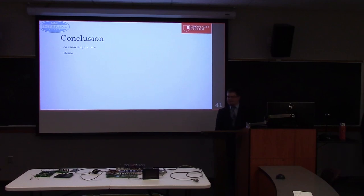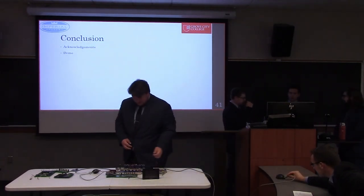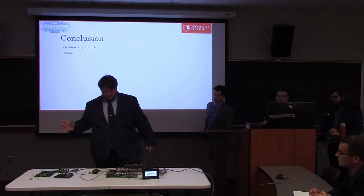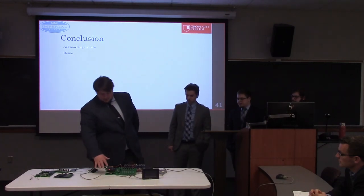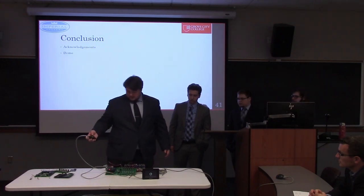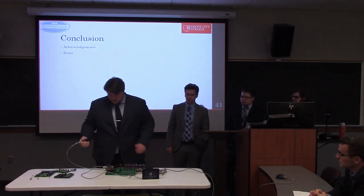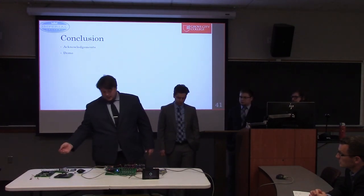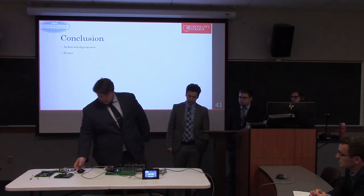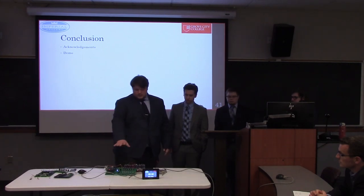Now we're going to do a quick live demo. On this board you can see the onboard display reading the pressure. We have a blood pressure cuff connected to our pressure sensor to simulate the dirty can filter that goes into the dust collectors. When we squeeze it, the pressure increases. When the pressure is above six inches of water column, the high alarm light turns on, and the pulsing circuit begins to pulse. Once it drops below two inches of water column, pulsing stops. That's how the onboard mode works.